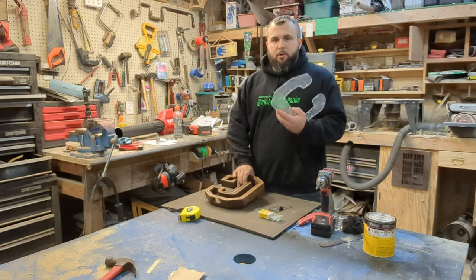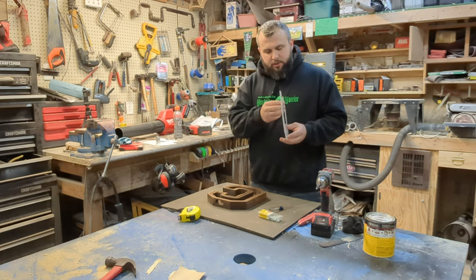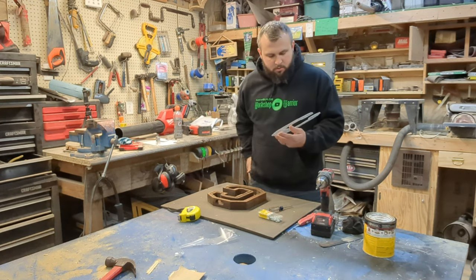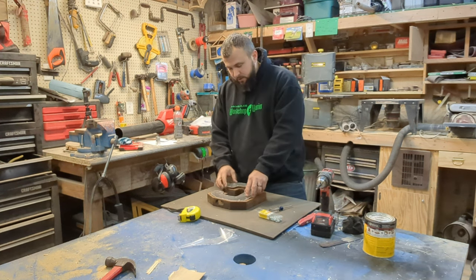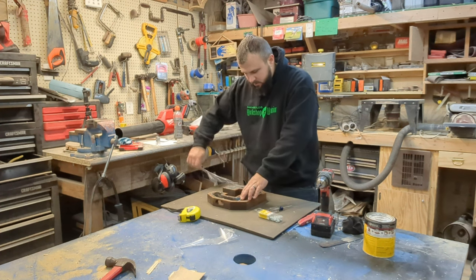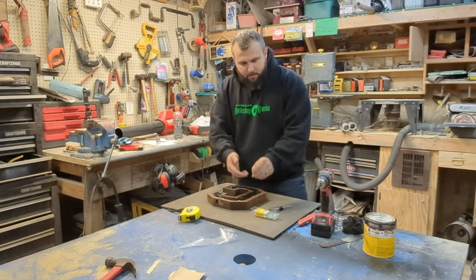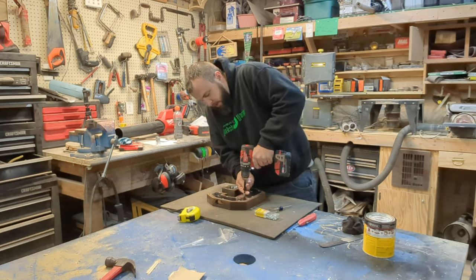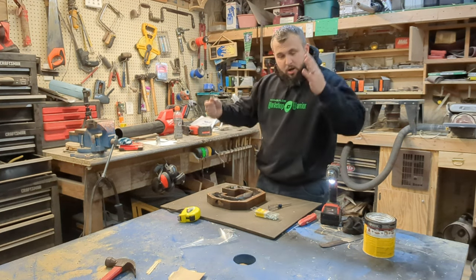This thing is now dry. I'm going to peel off the back protective layer of the acrylic, clean up the edges a bit, and wipe it down to make sure there's no debris - because once it's set you can't get to the back side. Place it on, peel off the front protective layer. I have half-inch self-tapping screws - I'm not going to drive these all the way in because I don't want to crack the acrylic. I'll get them most of the way in, then go back with a hand screwdriver to finish tightening them.